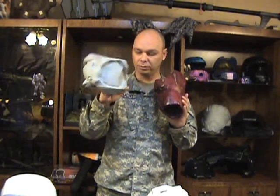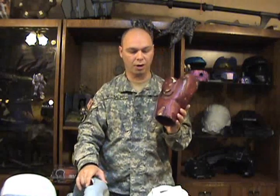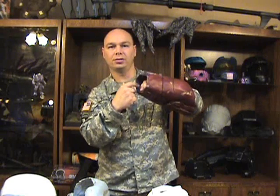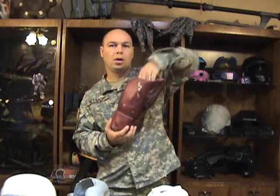This is Adam's also. It's the shoulder. You're going to block it off. You're going to put the cardboard from the inside and then hot glue all along the inside edge. That way your real edge is still untouched and unedited by the hot glue when you create your rubber mold.